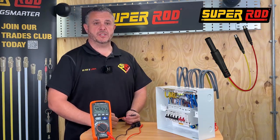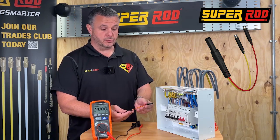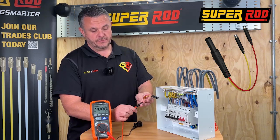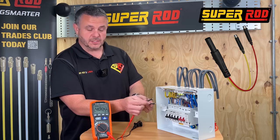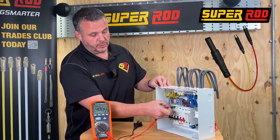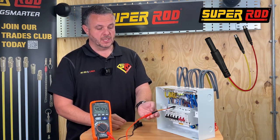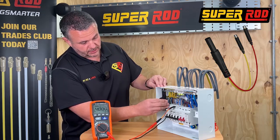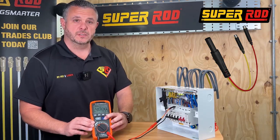As we're using more and more RCBOs in our installations, the IR link is the perfect solution to connect line and neutral together. It can be quite frustrating for an electrician to take conductors out of their terminations when you've spent a long time making them look neat and tidy. We have a magnetic probe here that sits into the terminals to provide one end of your meter connection, and then you simply need to connect onto the earth bar to test at 250 volts with line and neutral connected together to earth.